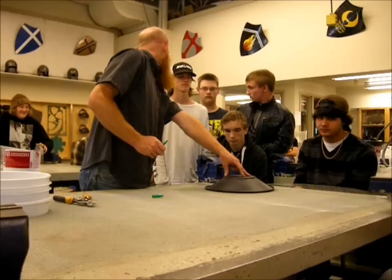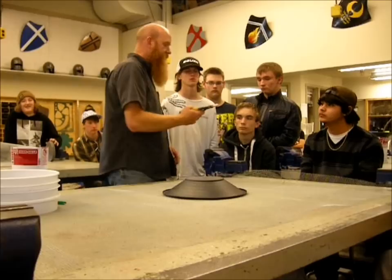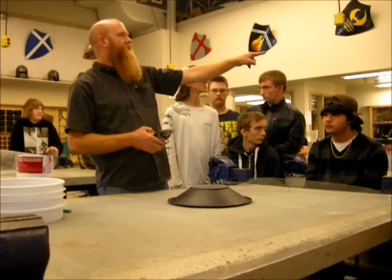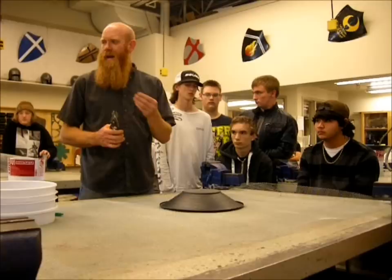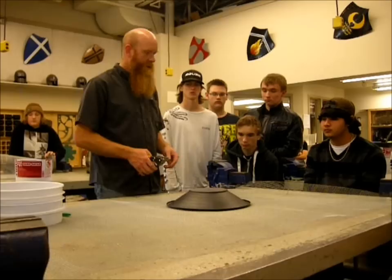Pay attention, please — put the phone away. About a quarter inch bigger than that gold pan all the way around will be the perfect size for you. We're going to use these aviation snips to cut this out. Don't use the regular tin snips up on the board — because we're cutting through wire, it would chip the teeth. Aviation snips are already a little bit serrated in there, which makes them withstand this kind of activity a bit better.